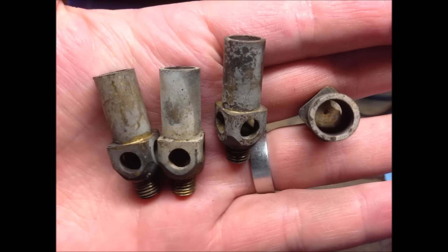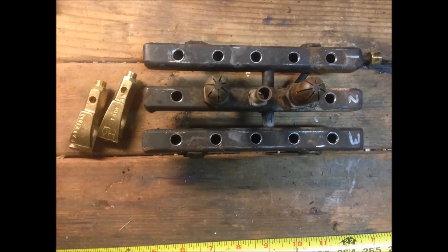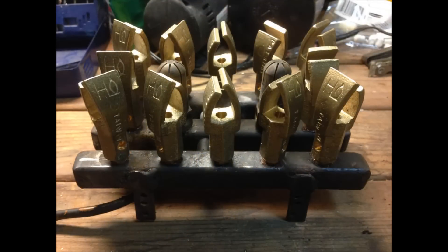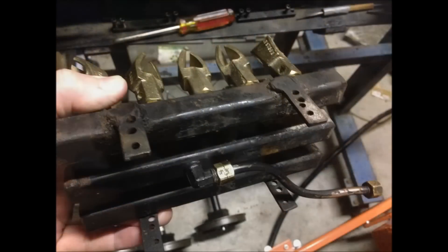As it turned out, the home brewery burner tips did not work so well, as I was not getting full combustion of the propane. Three of the old burners were left in place. Dale was having good success with his conversion to duck bill tips. Twelve duck tips were added — they provide plenty of turbulence within the firebox to get good combustion.